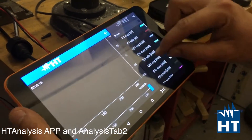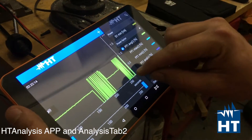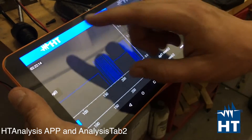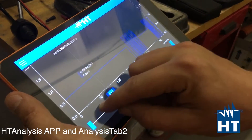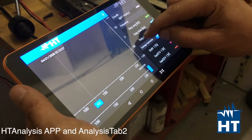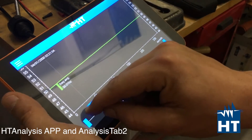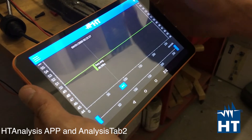We can do a lot more. We can even see power factor, for example — pretty stable at 0.59 to 0.58. The frequency — you can analyze it, it was pretty much stable from 49.98 to 50 Hz. You see, these days the frequency is not always a stable 50 Hz. You can also see the THD — the Total Harmonic Distortion — of the voltage, for example, which is pretty much stable. And here we have all the harmonics of voltage.